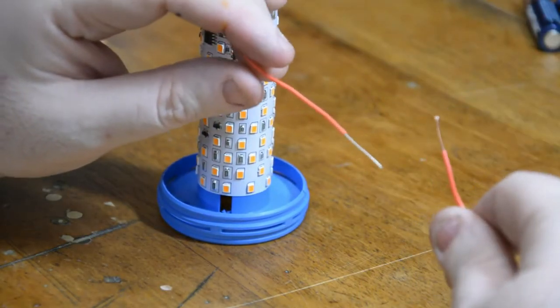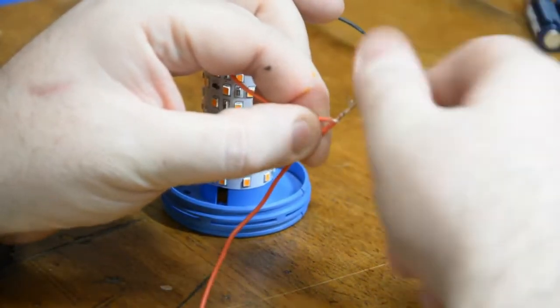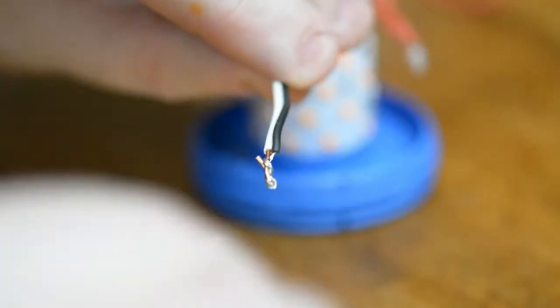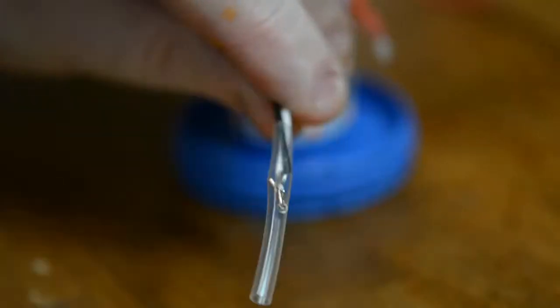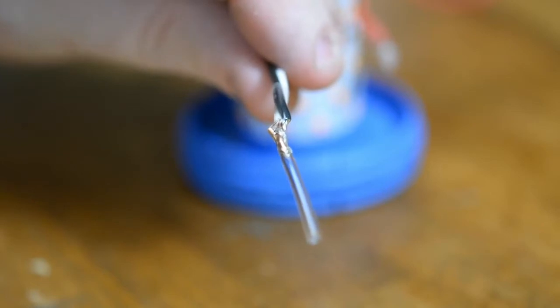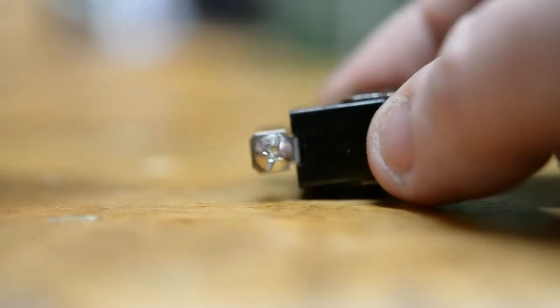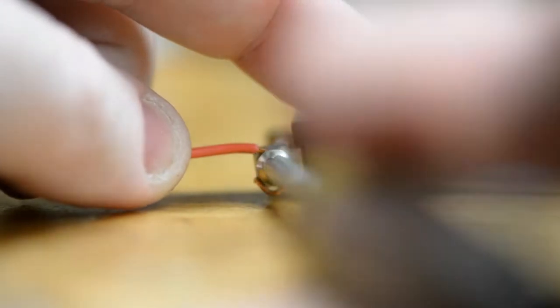Let's take a look at how I made some of those connections. What I did first was take the two exposed wires I wanted to attach and twist the exposed parts around each other multiple times, grab the set of pliers, and fold the wire again over itself. Then I took some heat shrink — I'm using clear here so you can see exactly what happens — and slide that over the twisted wires. Grab your lighter, keep it a good distance away, let the heat hit that plastic, and it shrinks around those wires. After a couple of seconds it cools and hardens, holding everything in place. All wire connections are made the same way, except those attached to the switch.